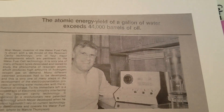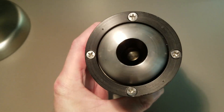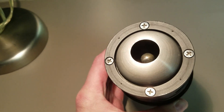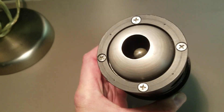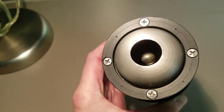So I decided to build one. I designed it in Sketchup first and then built it from there. It was made on the mini lathe. The outer sphere is two inches; the inner one is I think three-quarters of an inch, and that inner one was a hardened stainless steel ball bearing. They're both made out of 304 stainless, but I had to heat that up to like red hot and then let it cool down in some sand — that softened it enough to drill it.